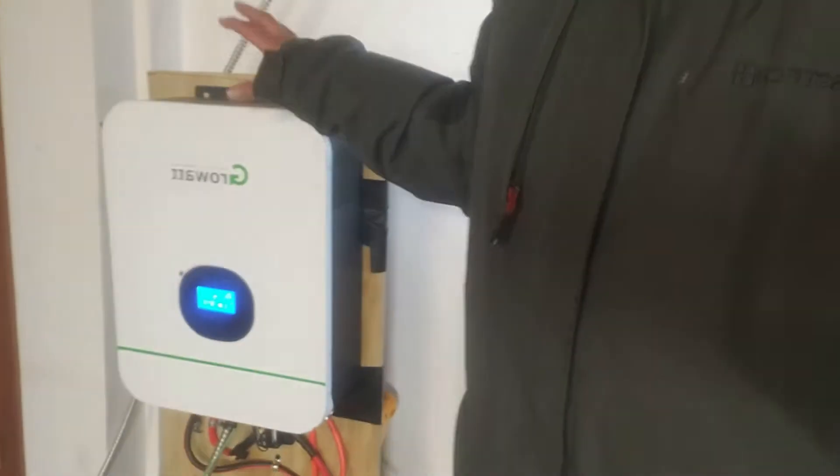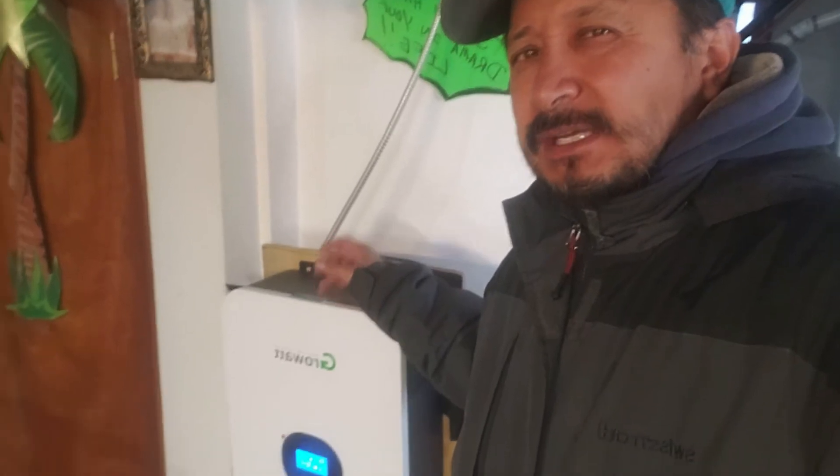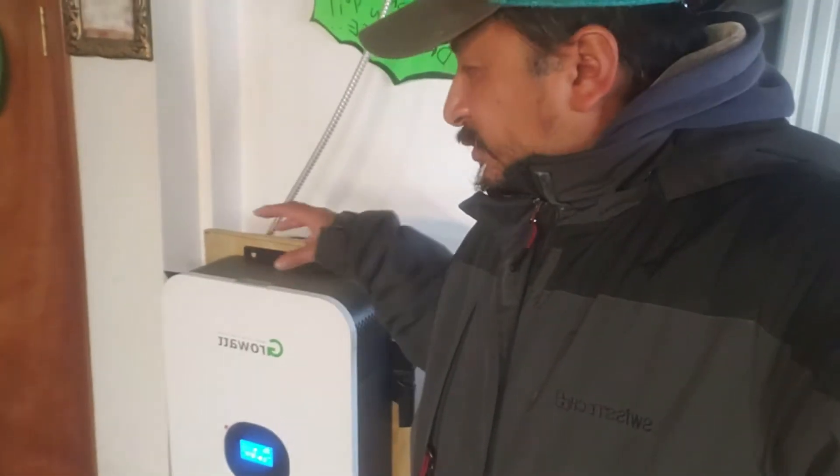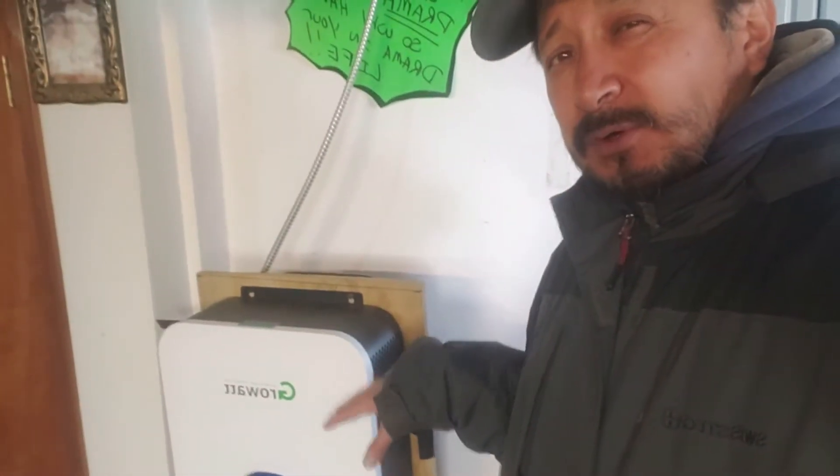I have enough solar panels right now. The four Renogy solar panels will keep me going and get some power juice. This is about one kilowatt hour of power in that cooler I made with the LG ChemPAC. When you turn it on with just the four Renogy panels, you do get power and maintain it for a couple hours, but the battery will continue to deplete over the night — down to maybe 52 volts by morning. Then the sun comes out and it charges again.